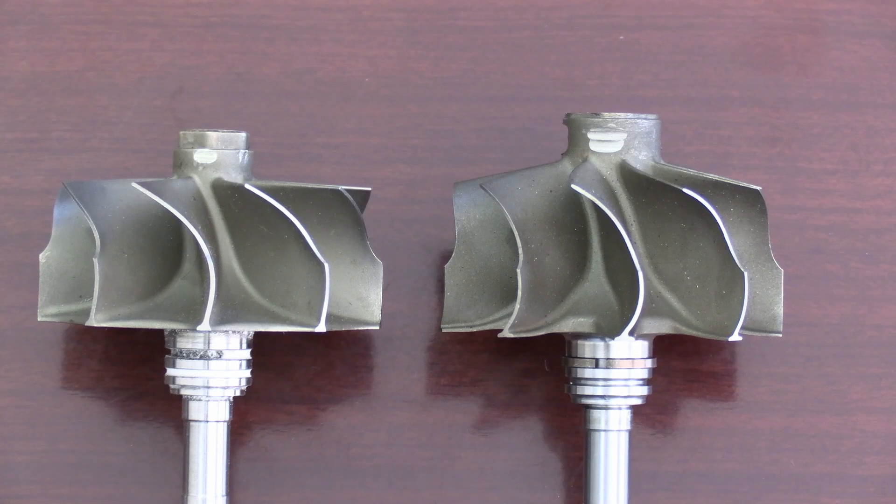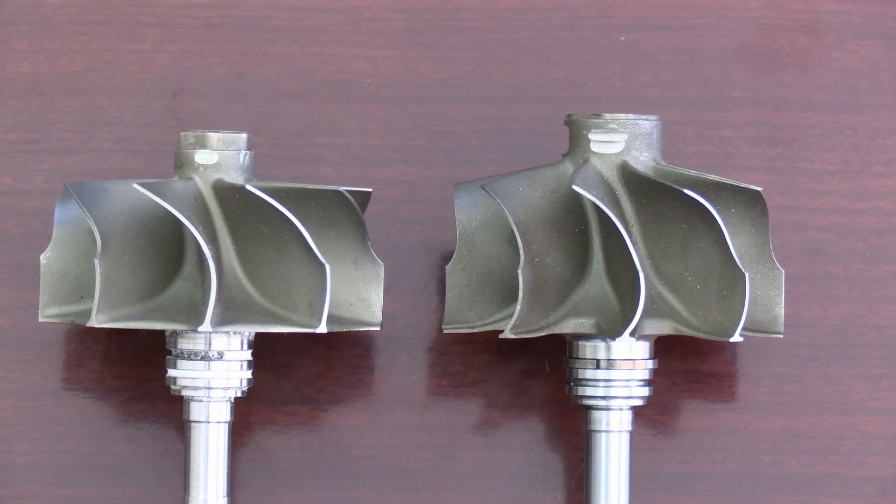So first of all, you get two different types of turbine blades — one with and one without a cutback. You get lots of different designs, different number of blades, etc. But typically your main blade, where you have the same height blades, you will find that you either have a cutback or you don't. Now on your screen you'll actually see two blades: one on the left that has no cutback and one on the right that has a cutback.